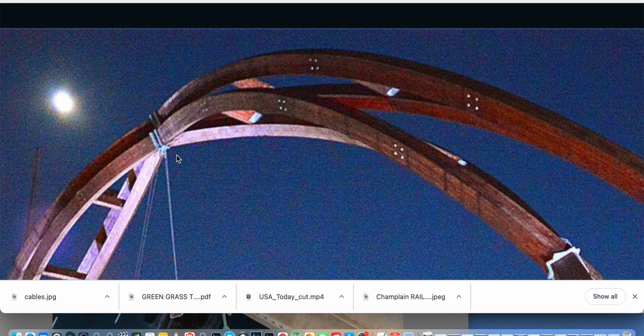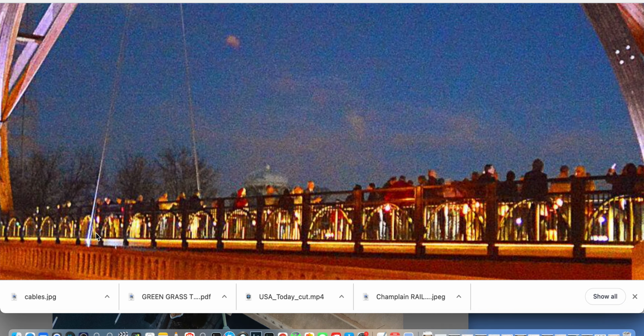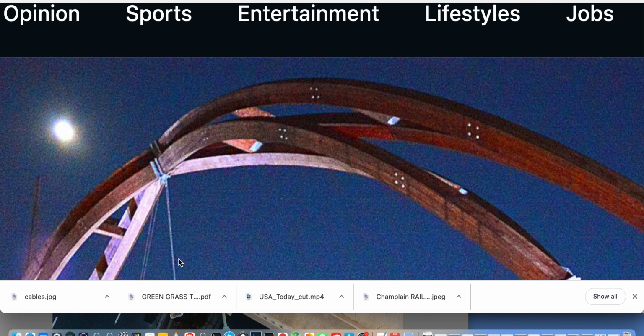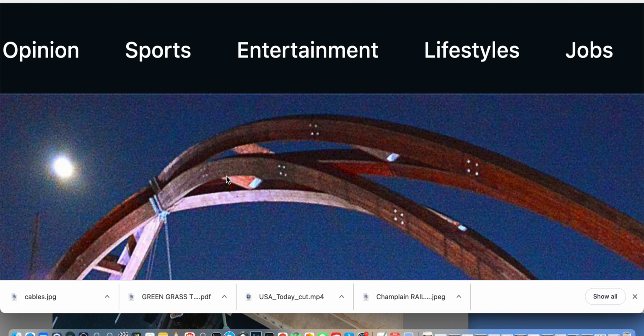It might be an illusion on my part, and it might go right through this bow tie, if you will, and grab that one and go down there. That doesn't make sense, though, because they're going down on the same side. So yeah, two going on that side, two going on that side. So these have to be connected to keep this from going, because if you only had it on one, you would be tightening this cable, just pulling it over. It would fall over. So these two have to be connected at this point then.